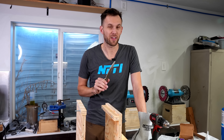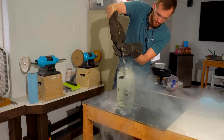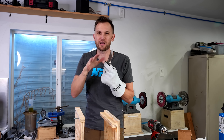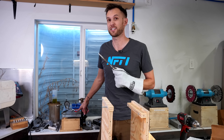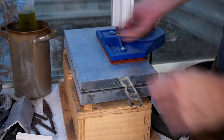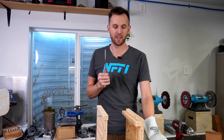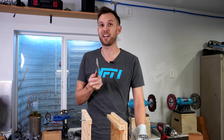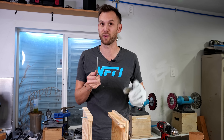There's a second problem that we're hoping dry ice will fix. When some steels are quenched, especially if they're getting too cold, they have a tendency to warp — the metal will actually contract unevenly on different parts, and that will bend the blade. Sometimes I'll use aluminum plates while blasting a knife with cool air to keep it perfectly straight. So I'm hoping that smashing the knife between two pieces of dry ice will work like those plates and help keep it straight even though it's cooling down really fast.